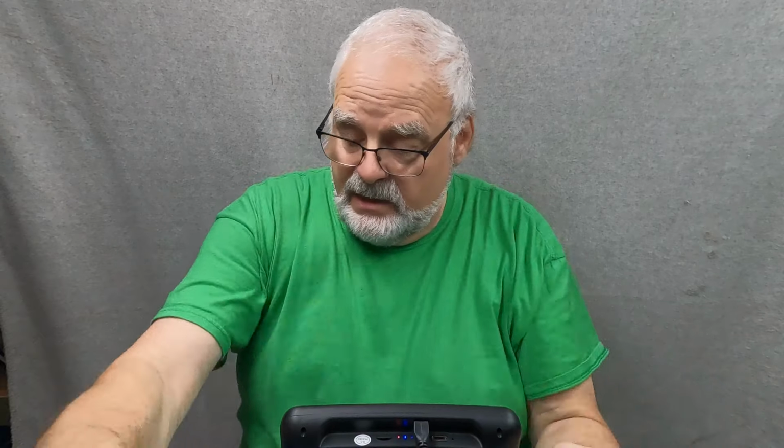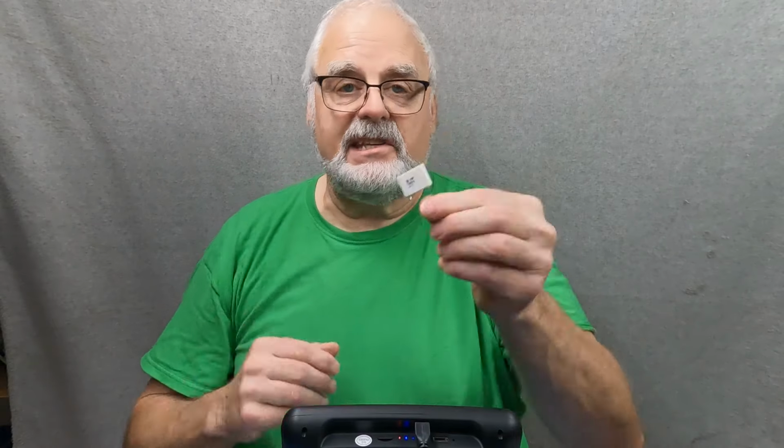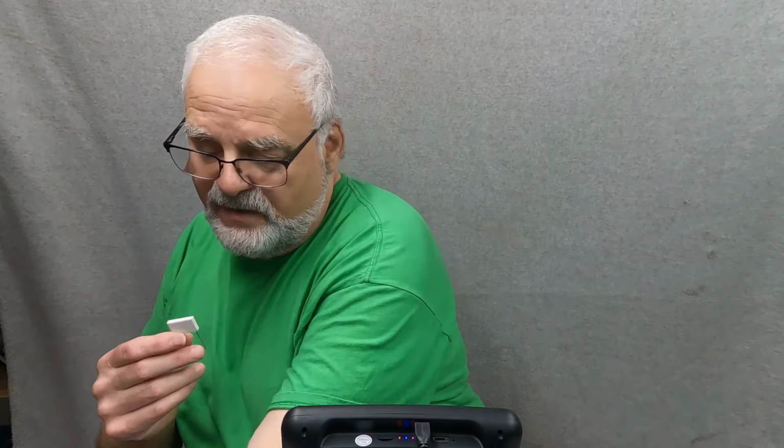All right, I'm going to move this back up and change the focus back to very wide again. And we're going to look at another sand type resistor. This one here is 0.68 ohms. So being a very, very low resistance value, I would expect this to have a lot less wire and significantly thicker wire. Let's see here. Let's focus this in.